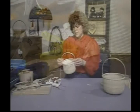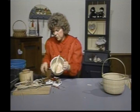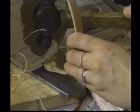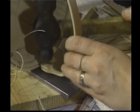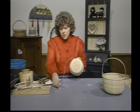Your rivet is going to stick out a little bit, so you're going to have to cut it off. With some wire cutters, come in here and snip that rivet off next to the wood. Then use your ball-peen hammer to mushroom that out, so that rivet won't come out. Repeat that step on the other side of the basket, and that's going to hold that handle in.